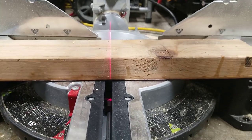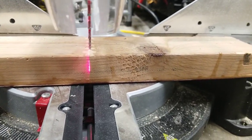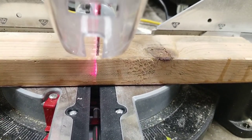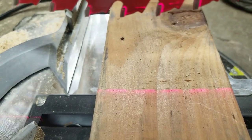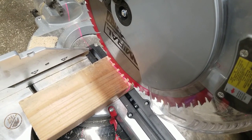Now I'm going to test the laser by plugging the saw back in and seeing what it looks like on the workpiece. Here's the laser — I'm going to lower the saw blade. It's just touching the workpiece and you can see the laser is actually touching the inserts slightly. You can see the shadow of the blade inserts on the workpiece — very, very close to the blade. You can't get any closer than this. You do lose some of the laser line but this is a much more accurate guide because you know exactly where you're going to cut. And that is how to adjust the laser guide on a miter saw. Thanks for watching.